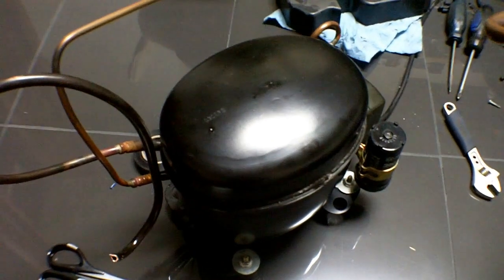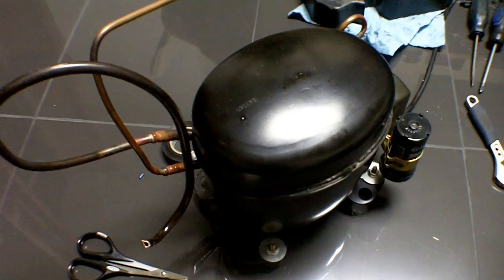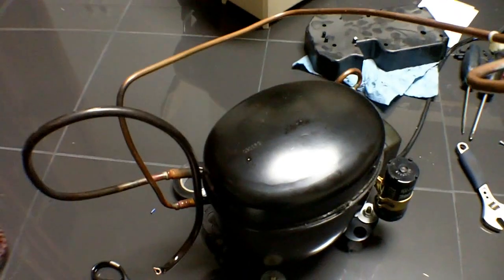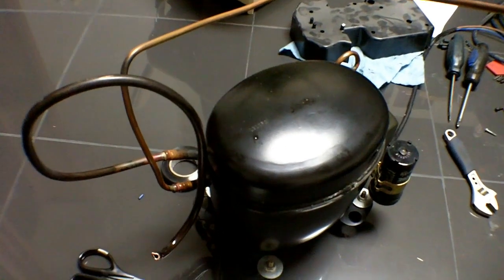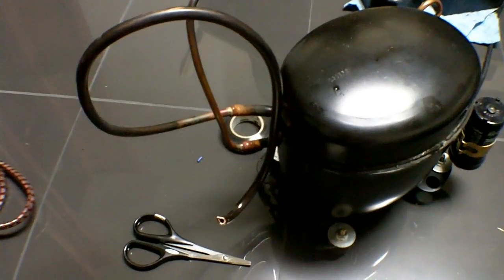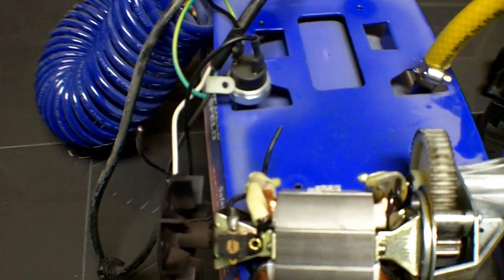The advantages of using this type of compressor is it's quiet and the air output is more or less a little bit better than what came originally on this compressor. Now there are drawbacks — this system requires lubrication. Since this is normally a closed-loop system designed for inside the refrigerator, the refrigerant includes oil within itself so it's self-lubricating. But now that I've cut the line, there's no supply of oil. So once in a while you will have to put some oil into the intake — something like machinist oil or 3-in-1 — just to keep the compressor from seizing up.